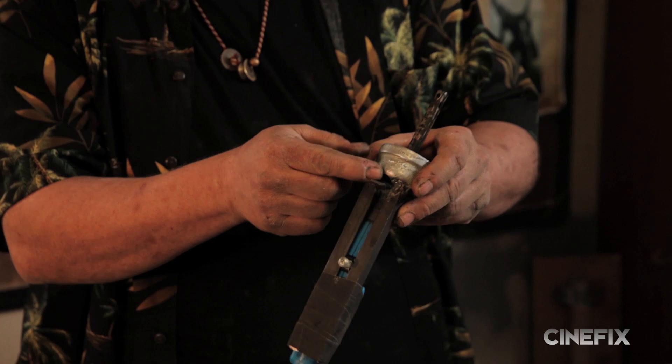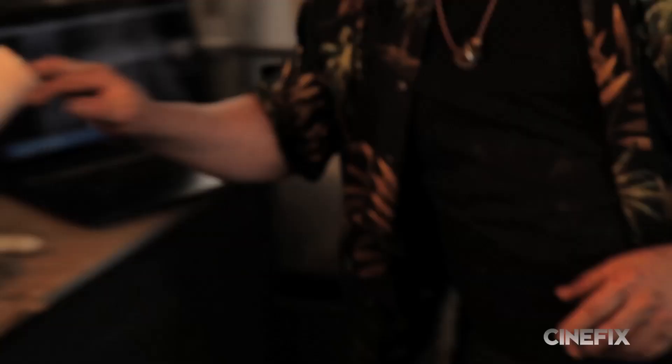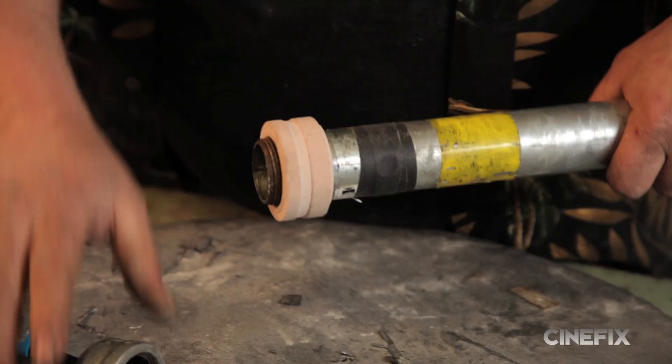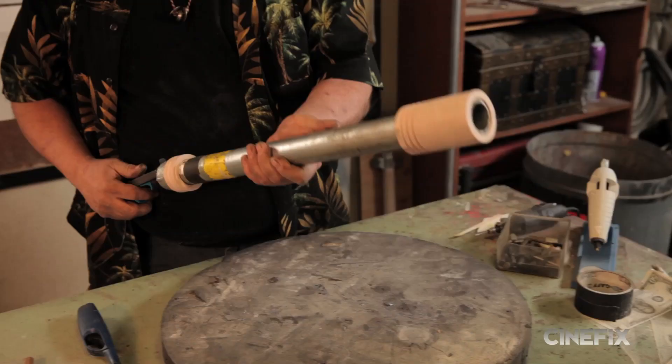And I put a breather hole in the back. I turned a piece of tooling foam on the lathe and hogged out the center to give us the end of the barrel. The final piece looks like this — it's just the base with no details yet, but it slips on like this. And on this end, I turned another piece — these are kind of like our bases. You can start to feel it coming together.